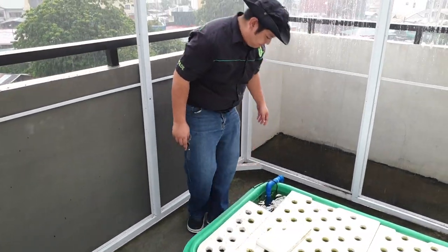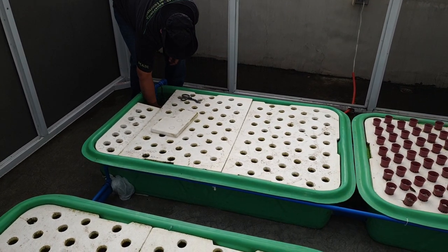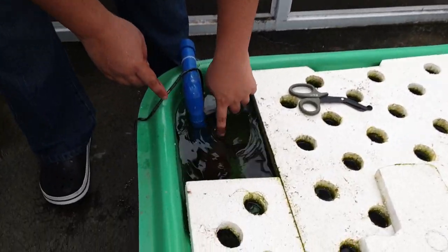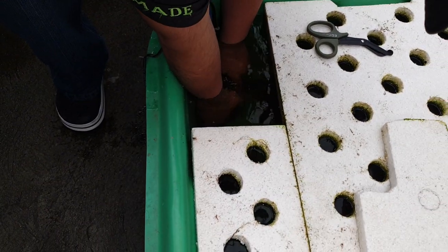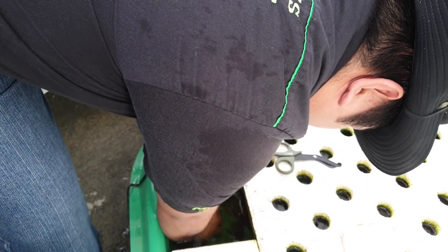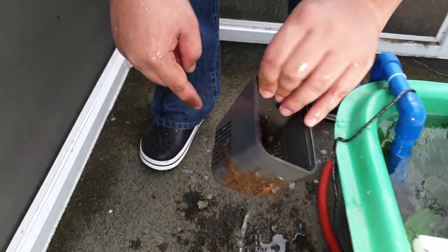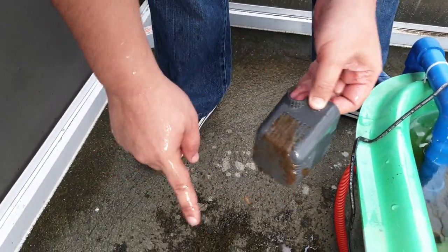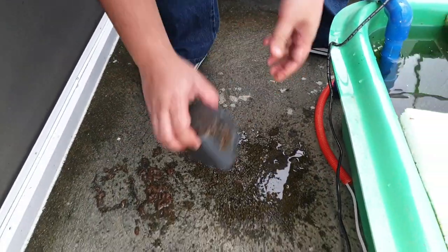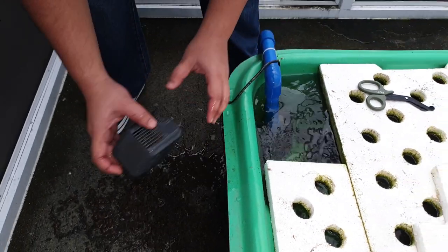Let's look at the pump. After 2 months, you have to maintain your strainer. As you can see, the strainer is already plugged. You just remove it carefully so you don't disturb the sediments, then clean it — give it a tap and a rinse outside your system — and then it's ready to go again.